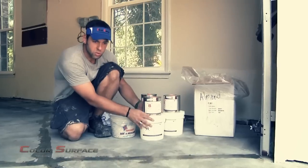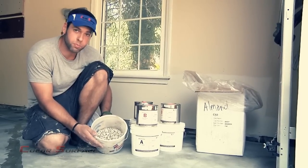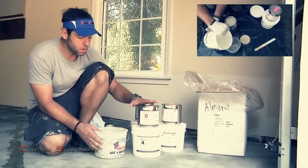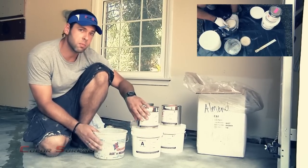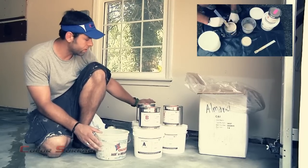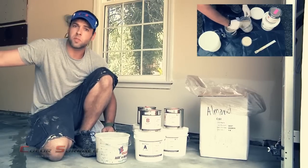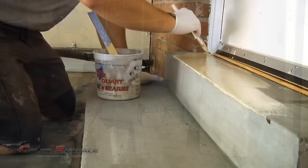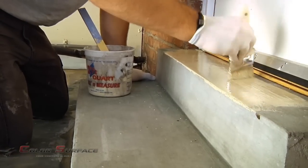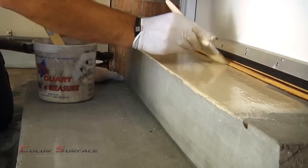Now what we have to do is apply a two-part epoxy color coat. This is wheat, which is a light tan color. And then we have these decorative flakes that are quarter-inch pre-blended vinyl paint chips that will be broadcasted onto the wet epoxy. This is an industrial grade, commercial grade epoxy. It's a two component — once you mix the A and the B, which start off as a liquid, they will actually form a solid. This particular epoxy has an extremely high pigment concentration, so it avoids the need for a primer coat, where a lot of systems you would have to do two coats of the color in order to hide the substrate. But with this, you can do one.